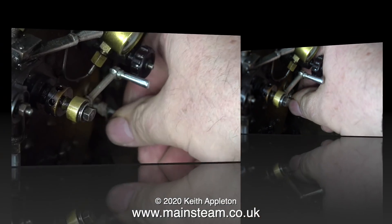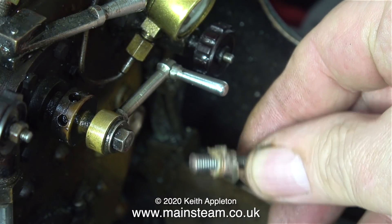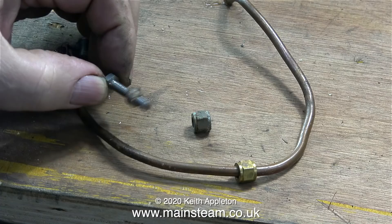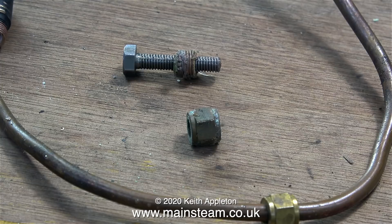I was lucky — this came out very easily. I didn't stage this; this is just as I removed it. I didn't remove it first, screw it back in, and then take it out for the video — this is the way it came out. And if I want to reuse the 2BA bolt, all I have to do is heat it up a little bit and just screw off the piece of broken clack valve. So I'll keep the bolt and throw everything else in the bin.